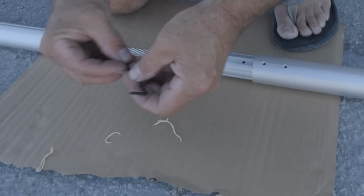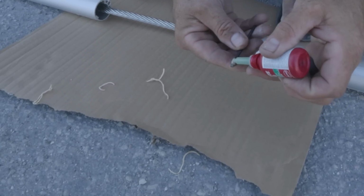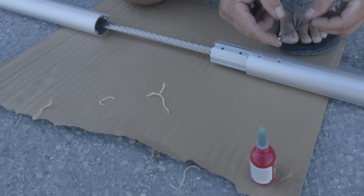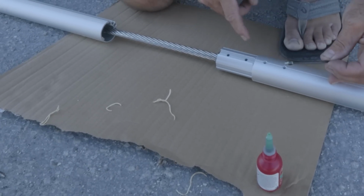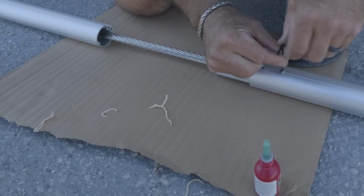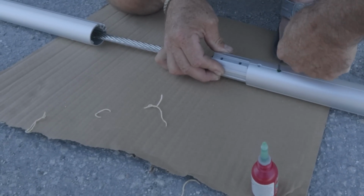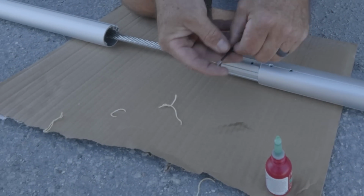And then we're using Loctite, and they actually sent that with the extrusion. So this is the recommended. Correct. Put it on the threads. And then the threads actually thread into the extrusion, and the smooth part pushes against the bearing. It slides inside of this to keep this from sliding, and then it pushes on that plastic bearing on the inside. And how tight do you tighten them down? It's like 35 inch-pounds, which is about, in my very technical measurement, about that much. Ah, perfect.